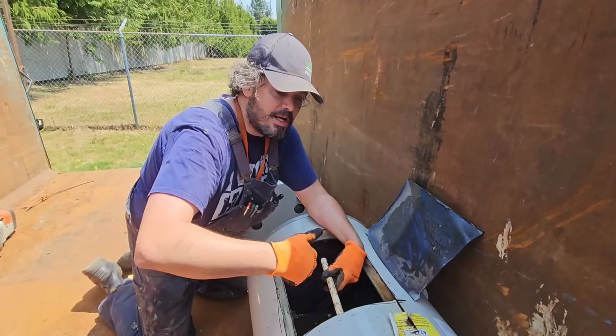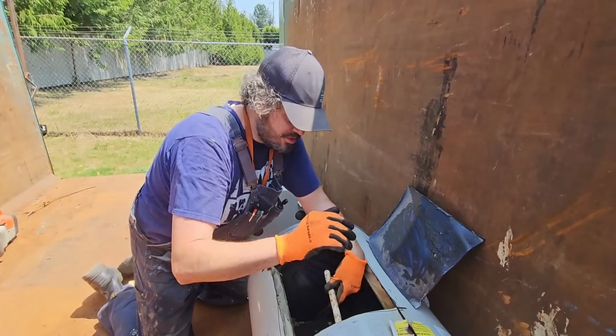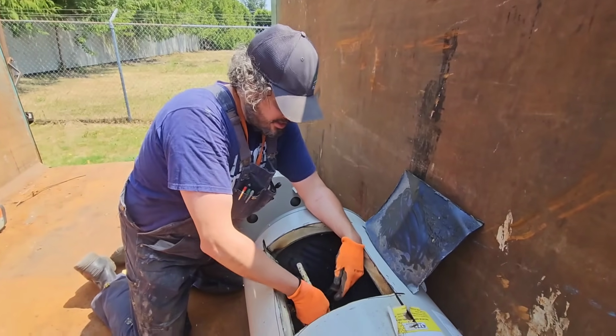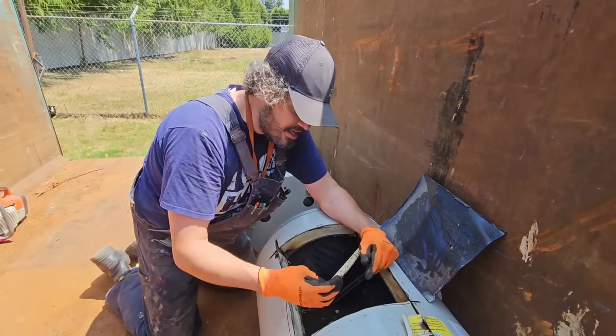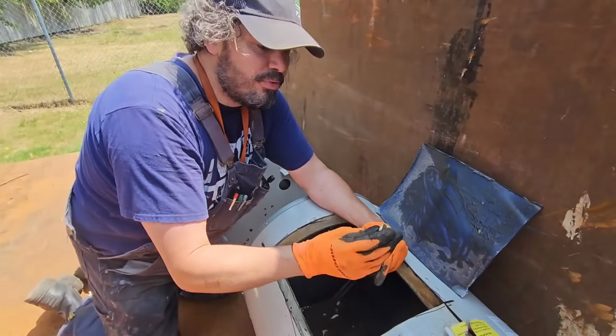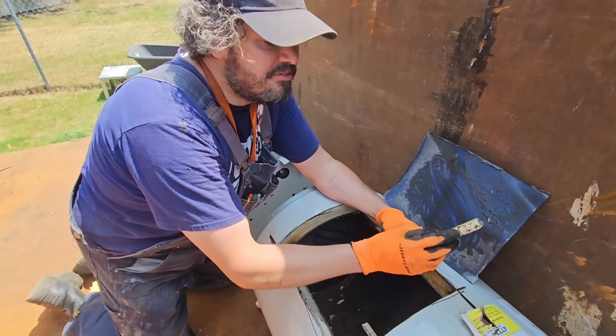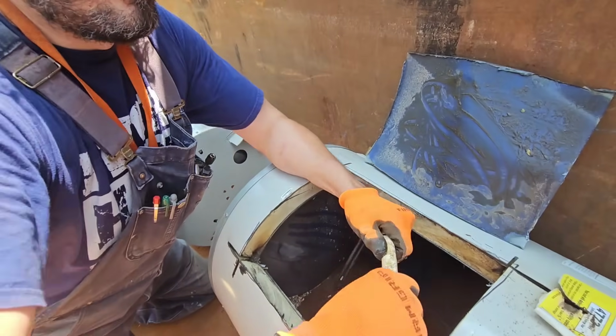So it's stirring it up. It's always stirring it up. A long shower, you're pulling everything. You're pulling most of the sediment that tried to stay in here out. So the Bradford Whites don't collect a lot of sediment if this diffuser rod stays intact. This one at some point in time broke off right where they got the diffusers. Look, perfect spacing. It broke off right there.